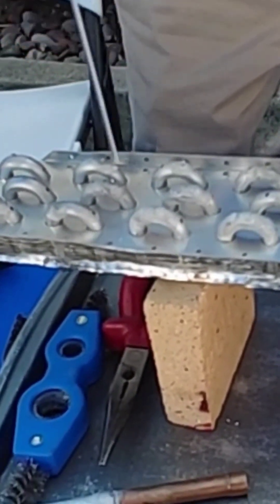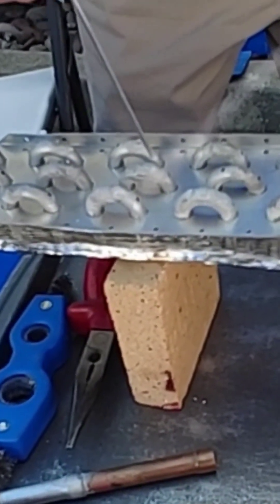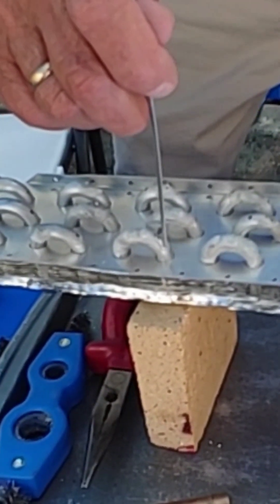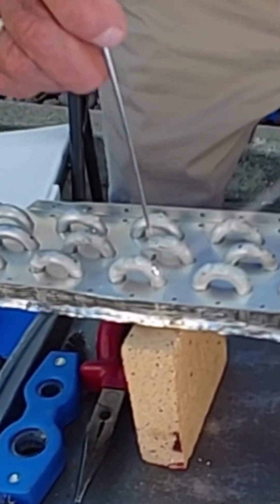The key is you want to get the surface to 900 degrees to melt this alloy. We don't want to put it into the flame. So you see I'm testing. And then when it begins to flow — right there — see what I do with the heat: back it off a little bit, then bring it back in. I like to control the rod.